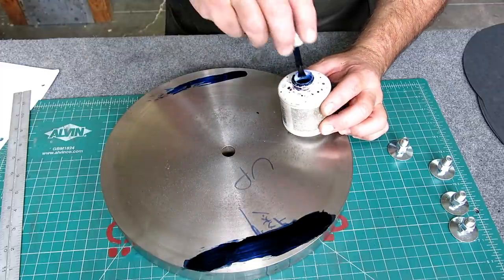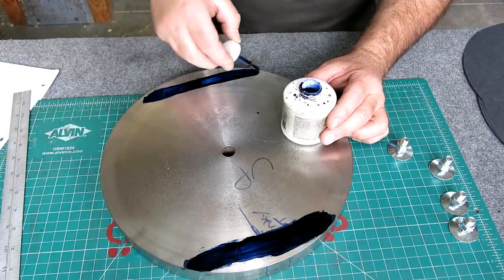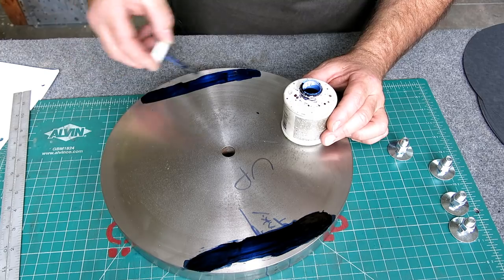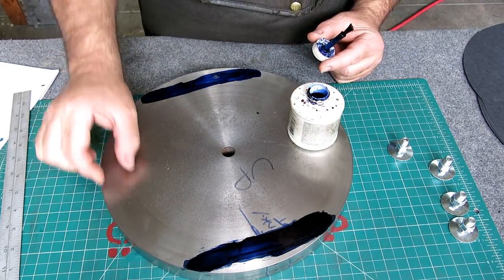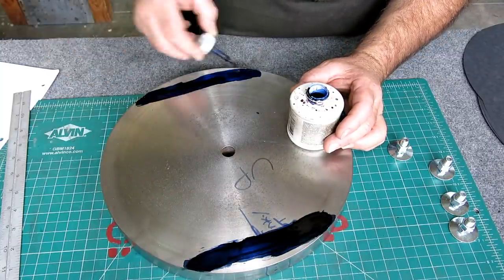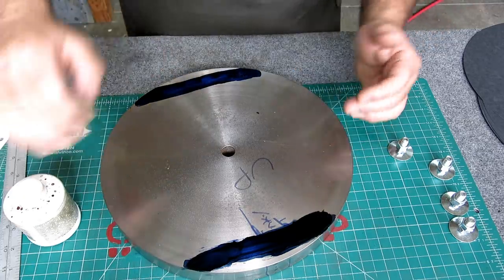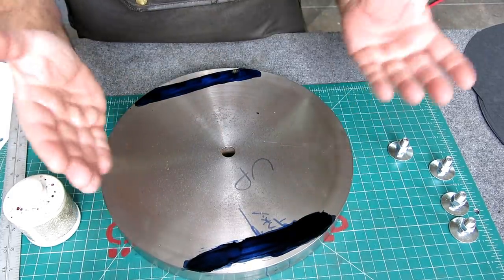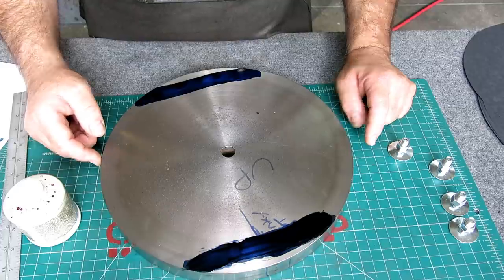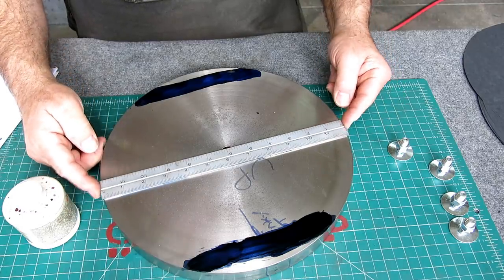So we're gonna cut some flats on this, and the reason is when you have a part that has a ledge on it or an angle or something like that, sometimes it's handy to have a straight edge to guide it in a linear along its axis. I guess is what I want to say, in too many words. So we're just going to mark this up, and then we'll make them parallel here. The last one I made four, and you don't really need four. Two is fine. We're going to saw it, and then we'll mill them so they're nice and smooth, and they'll be 6 inches long on this 12-inch diameter, 300-millimeter disc.